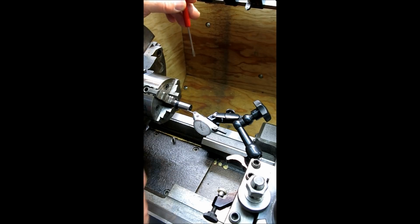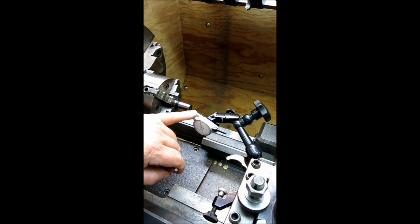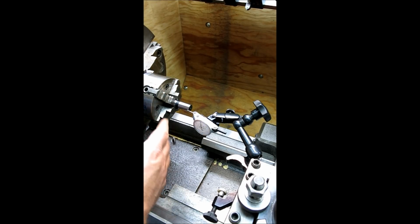So you'd traverse along, or you'd start here, you'd zero, you move it up and down until you find the high point. You zero your indicator, then you move, and hopefully the indicator's not moving. And then as a double check, you do the vertical again, right? Okay, and null the reading, and then back up and do the same thing. Now, that's kind of hard to do with standard stuff here, and in particular with a setup like this, all right? And so there's another way, obviously, that you can do that so that you can actually traverse that indicator up and down. But it's not very convenient.